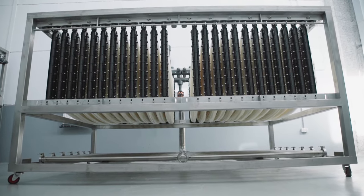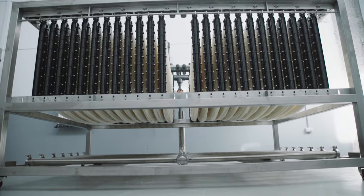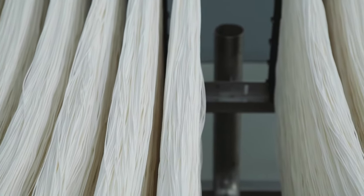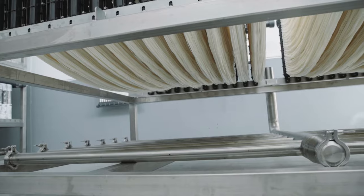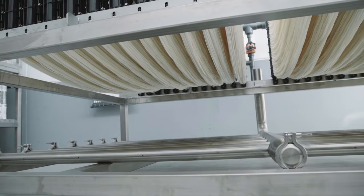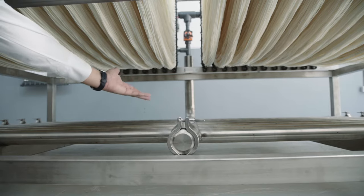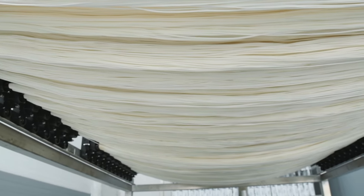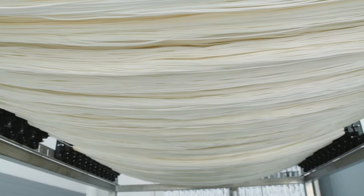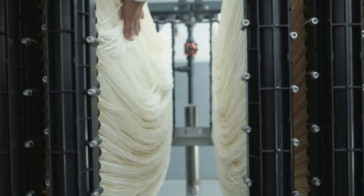As you can see, our membranes are placed horizontally and they are widely spaced. This feature provides several important advantages. In operation, our diffusion system provides two sizes of bubbles that continuously make a scouring effect on the membrane surface in order to keep them clean. Our horizontal distribution allows direct contact of the bubbles against the capillaries without barriers to the flow.